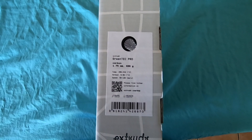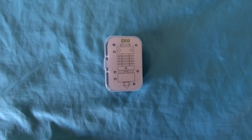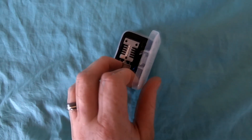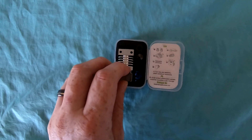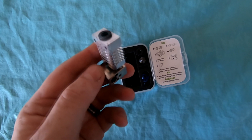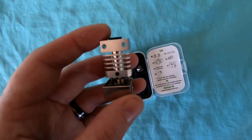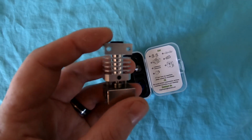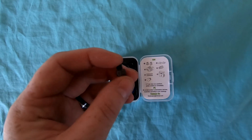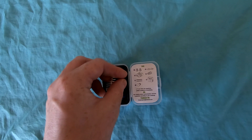We ended up picking up a 0.6 steel nozzle. Next up we have a full metal hot end picked up from Mellow 3D on AliExpress. Of course you can't print high temp stuff for long periods of time with a normal setup — the Bowden tube gets all yucky and starts clogging up. So we picked up this full metal hot end. It's a very solid feeling unit, it's got some weight behind it so you know it's quality. We've also picked up the nozzle. Let's get these on the machine and see what this stuff does.